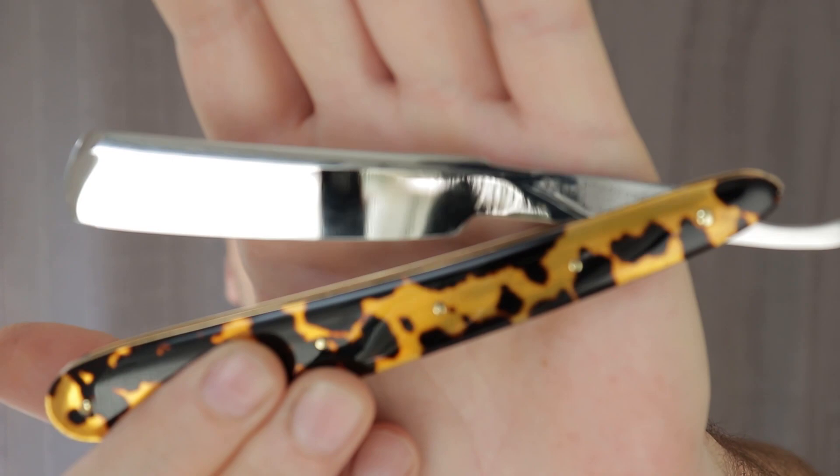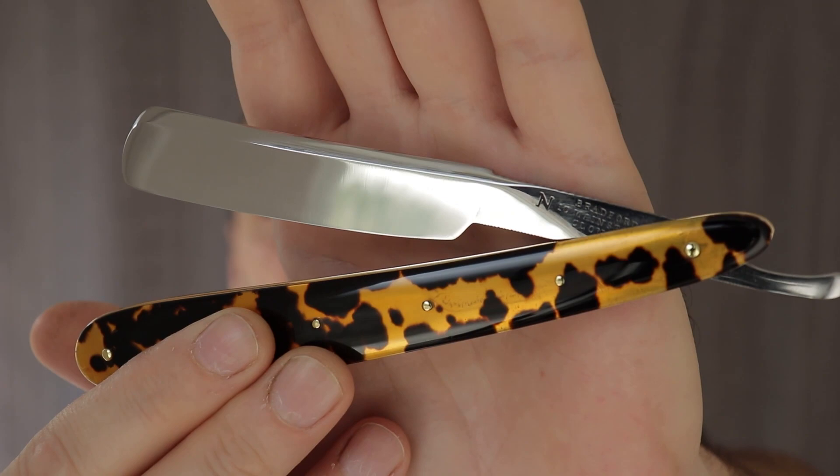Another issue I ran into last night when I was honing it was under the microscope. I noticed rainbow colours on the bevel. Someone had had a go at this before me — there was lots of rust and stuff, but back in the day someone had had a go at this. At the time I was thinking it was probably oil, but now I'm thinking what if the temp has gone. Whoever had it on a grinder back in the day ruined it. The bevel is super fine and straight — it really is nice. But I've got a feeling it's not going to shave at all, and if it doesn't, all I can do is save the scales for some other special razors, take these apart to get rid of that water stain, take off the tarnish, re-do everything, pin it and then seal it. That's a big job.